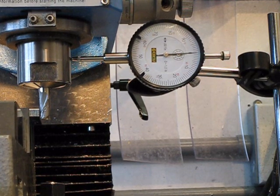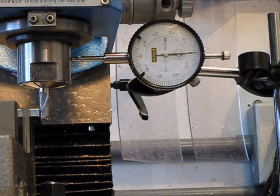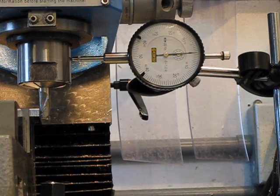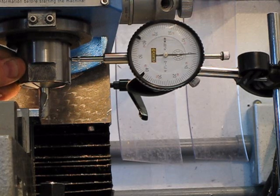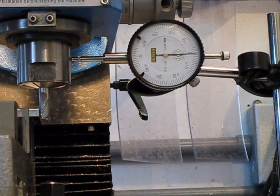The results are about the same, maybe a little bit better — not as much waviness. I took some pictures and I'll put that into the video as well. Now I put my dial indicator onto the spindle itself just to illustrate the flex and see if that is an area of concern. That's a fair bit of pressure and it's getting about two thousandths of play.